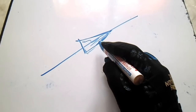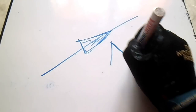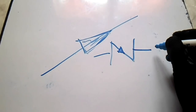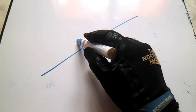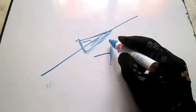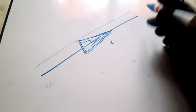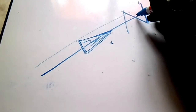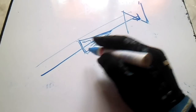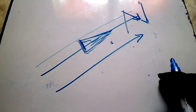Take note of this — it is very important. If you are installing a check valve, you must check the flow direction of the line so that the check valve is installed in the correct flow direction. The arrow shows the flow is going in this direction.